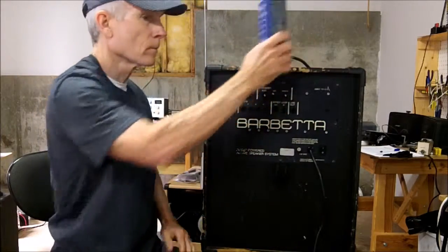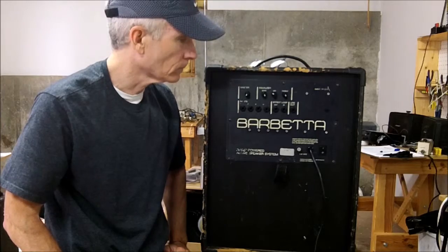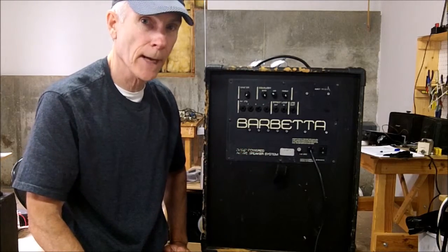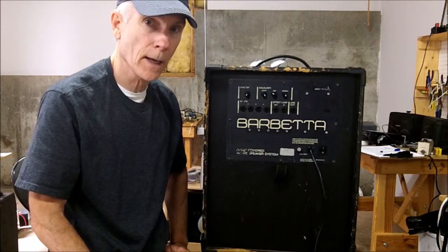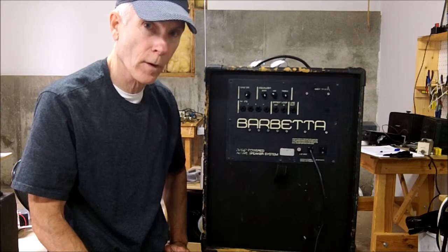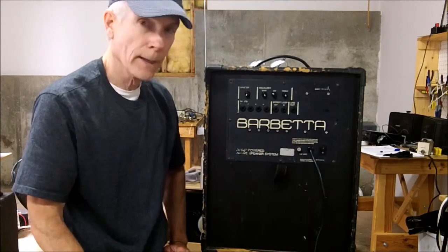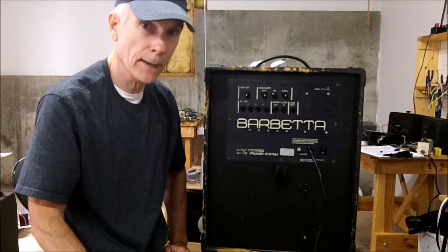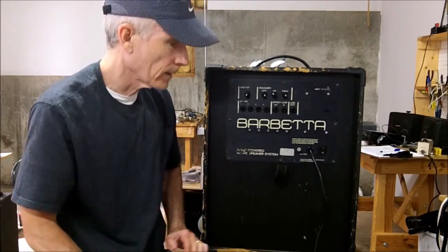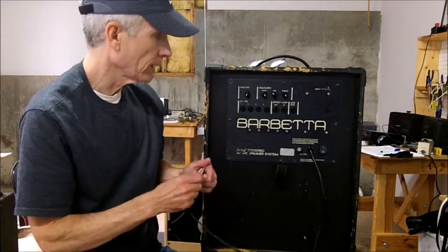I do three jacks at a time because the cleaner dries rather rapidly — I don't want it to be wet while I'm working. That may actually solve the problem; if not we can go back through and do it again. If it still doesn't work, we'd have to take it apart and look at the jacks from the inside, spray cleaner directly onto the contacts, or replace one or more jacks if they're damaged. While doing the work with the panel out, the unit was turned off and the power disconnected — obviously you do not want to be working inside the unit with the power on. Now we have it back together, plugged in, and powered on to test the inputs.